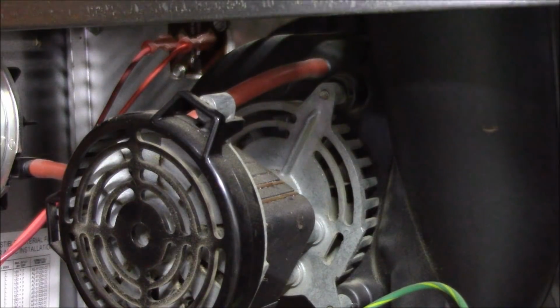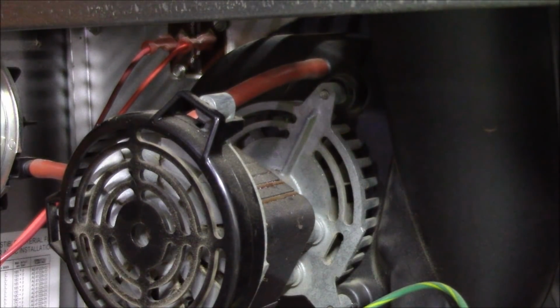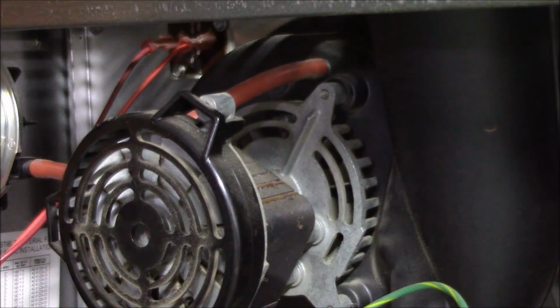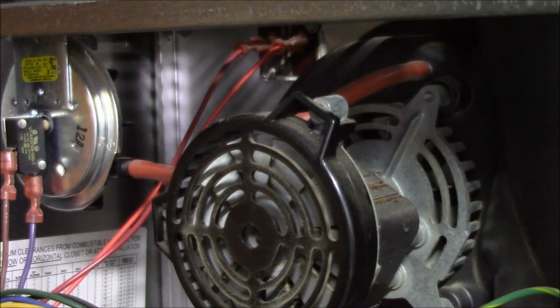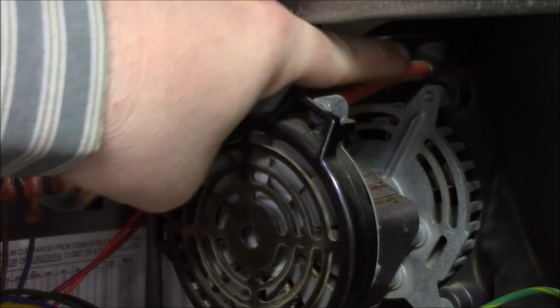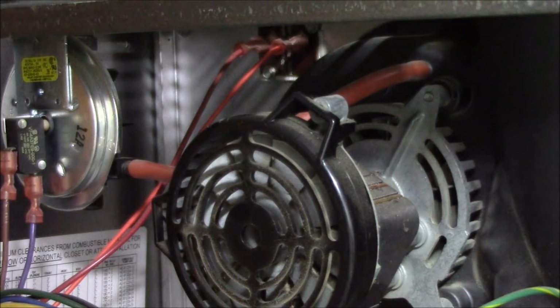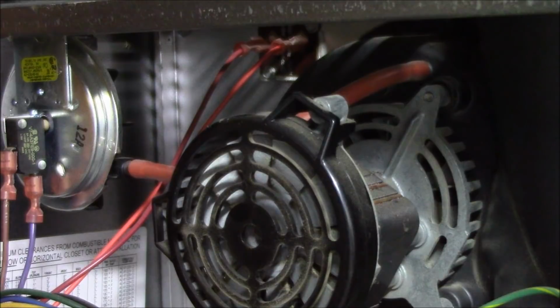One thing too, I have seen it where the burner's light shuts off, acts like the flame sensor, when in reality it came to a pressure switch problem. But it wasn't a bad pressure switch. The pressure switch is good, the hose is good, but the little port where that orange hose goes to on the inducer motor was plugged up. You'll find that very common in crawl spaces that are kind of damp. All you have to do is knock the crystallizing, whatever it is, out of there. It'll have enough air density to start it, but once it fires up, you don't have the air density anymore, and it kicks it out. And it won't give you a fault code. You have to see what's going on and understand what is happening.